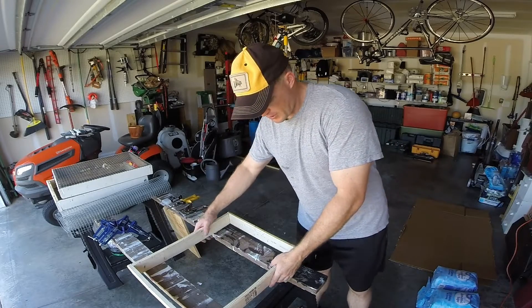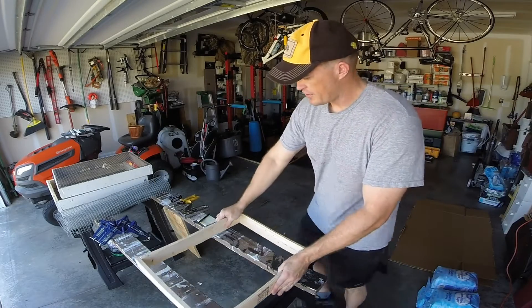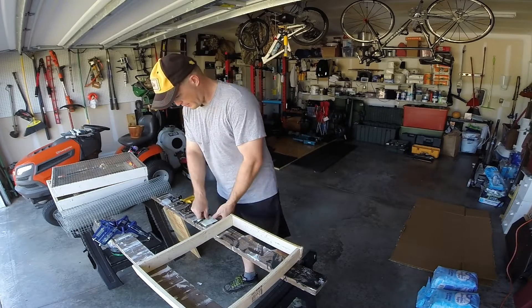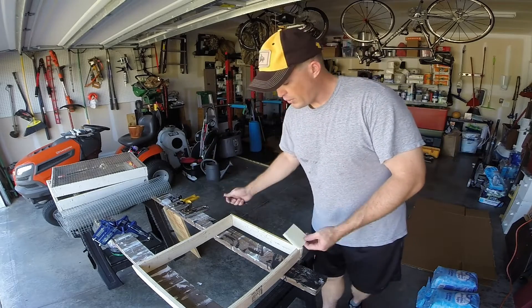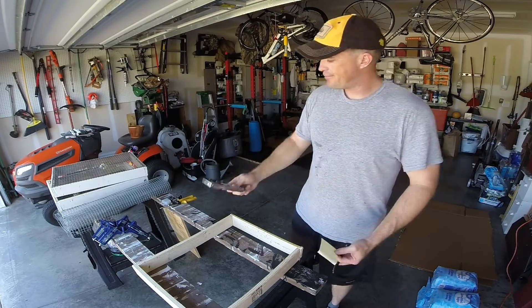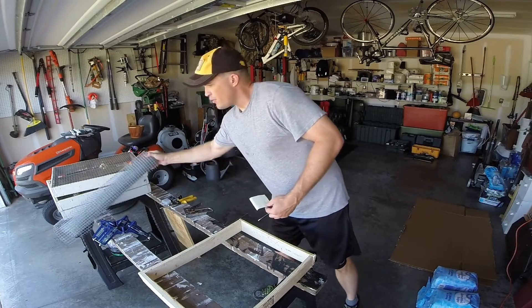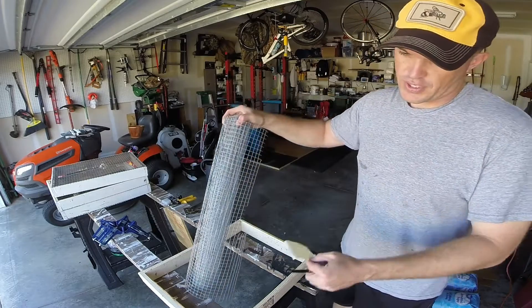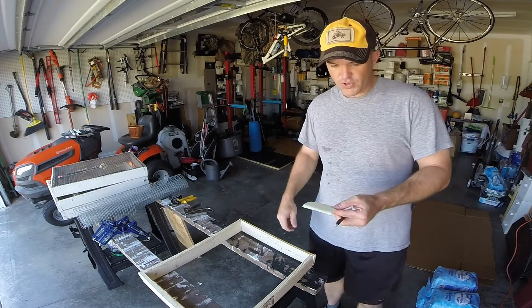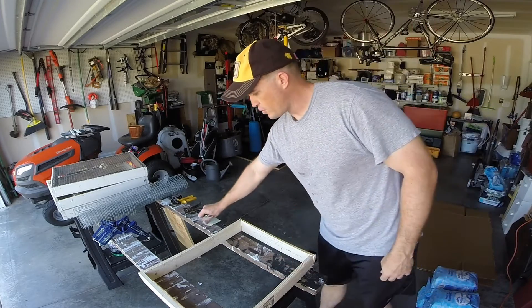Just finished with the last side — there you go, basically just making a box. The next step is to get the wire cloth on the bottom. The tools you'll need are just some snips and a staple gun, nothing fancy. Width-wise with the wire cloth, we're going 32 squares across and then 39 squares deep. I'm going to measure that out and make those cuts off camera so as not to bore you, but I will put those specs in the video description as well.